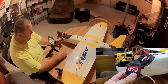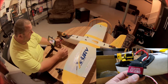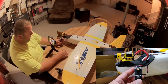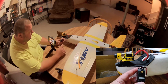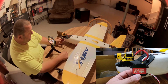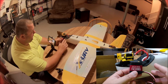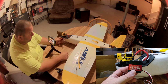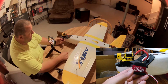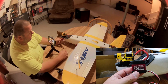But there is a problem with this servo, and the problem is if you just plug it in and don't do anything else and try to pan the thing, you're not going to get the full range of these servos. These are not like RC servos. I'll give you the number here. It's LD20MG. This is the 180 version. The one I have in there is the 270 version. I will link it in the description. But the problem is that RC receivers, RC radios, and iNav all run on a PWM width of 1,000 to 2,000. And this servo is designed more for robotics, I suppose, to work with an APM or an Arduino. So it needs a pulse width of 500 to 2,500.